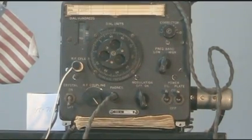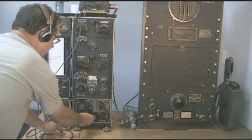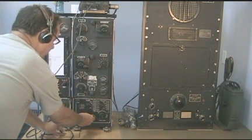Now we'll bring the LM on and we'll spot the master oscillator with the transmitter and zero beat it to make sure it's actually on the frequency we want to operate on.